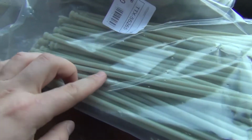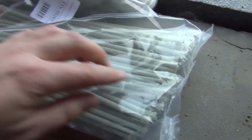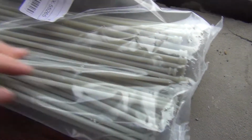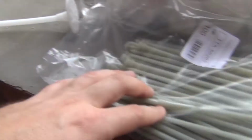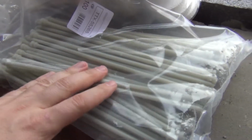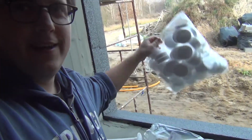These are not open. You can see these shafts or plastic nails or whatever. They've got a little hook on the end. So they go into this end piece here and spread it apart so that it holds in the wall. And this is, I guess, plastic also, some denser plastic, so it doesn't conduct heat like it would if it were a metal screw. So really fantastic. And then a whole bunch of these styrofoam cutout circles to fill the gap, and these just go like this on top of that, right? So that way we've got a good covering, and the house is nice and warm, right?